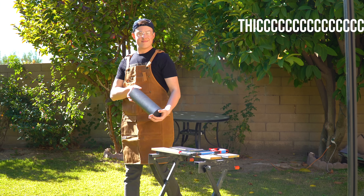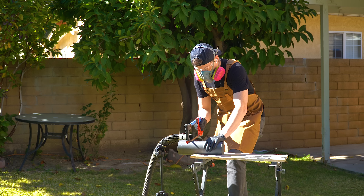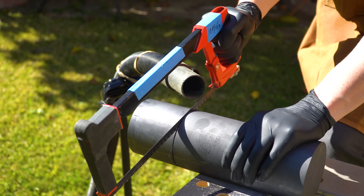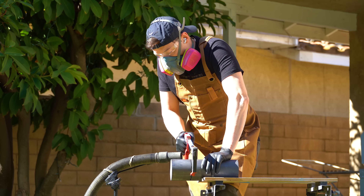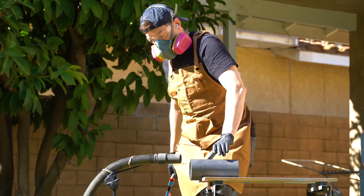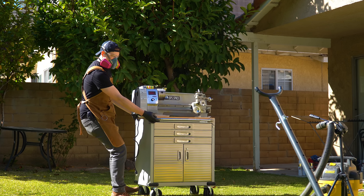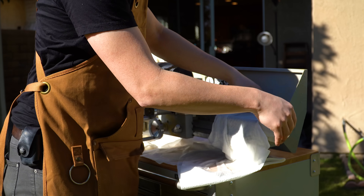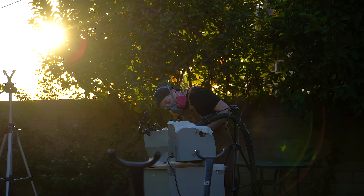I bought a thick, super-fine, isomolded graphite rod that was 4 inches in diameter and about a foot long. I chopped off a section to start making the throat. I'm doing this outside because graphite dust is highly abrasive — if you get the dust on machines like a mill or lathe, it can damage them over time. Graphite is also electrically conductive, so between those two things, you do not want graphite dust in your shop. So I rolled my lathe into my backyard and got to work. I covered the lathe in wet paper towels to protect what I could, and slurped up the rest of the dust with a shop vac. Machining outside is wonderful — it's a beautiful, peaceful experience.